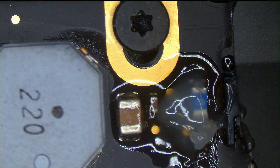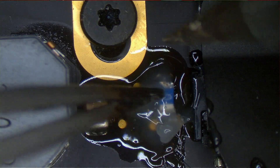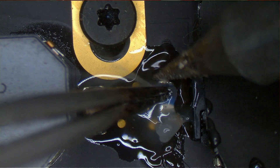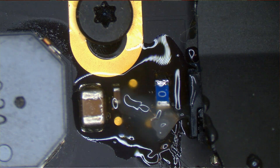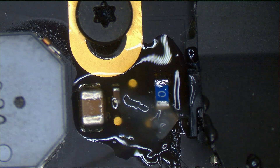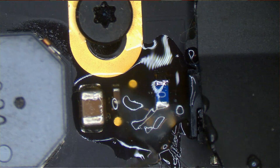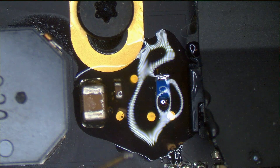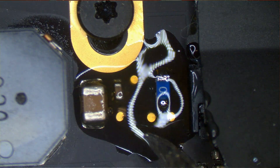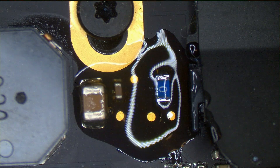Now that it's soldered on one side, I kept melting it without flux being present, so that joint was going to be crappy. I put some flux there, and now I have a nice joint. I also pushed down while doing that to ensure it's flat on the board. Now I'm going to take my iron, some fresh solder, make sure there's flux on the other side. I can't get the angle I want because of the connector in the way, but there we go. I clean the iron and tidy it up a bit.